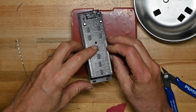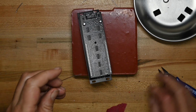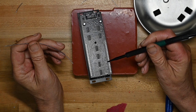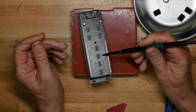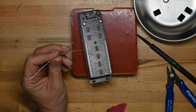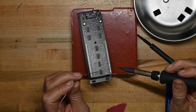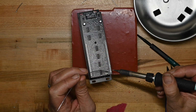The author of the build guide emphasizes, as I certainly would, when you're soldering here, these surface mount resistors are very close to these pins, and it is very possible for you to brush your soldering iron against them while you're soldering the pins. So be very careful and don't go this side, just go this side.